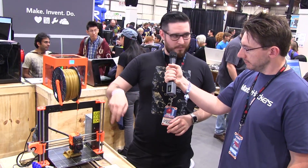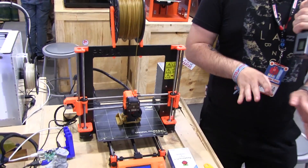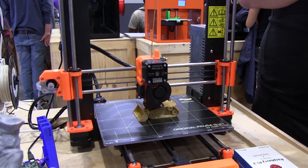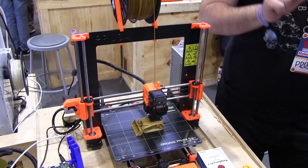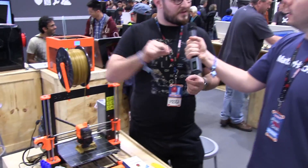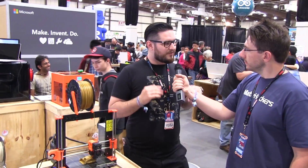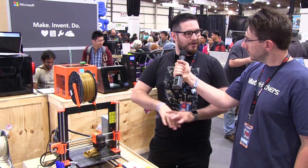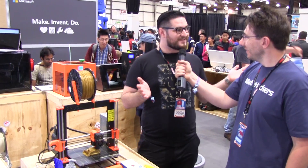We have nine points and the induction probe checks all the points. We had to make special points on the PCB because it doesn't register on the normal heating pattern, so there are just circles where the probe probes it. Then you take three points and put a curve through them. We approximate 15 points, so we have a 15x15 point mesh — a 3D mesh — and it uses this 3D model inside the Arduino to compensate for all these things. That's amazing. Well, we were surprised it works, but it works great.